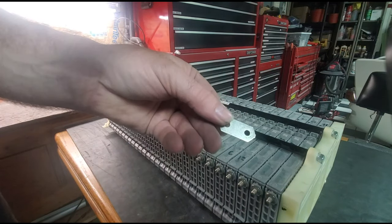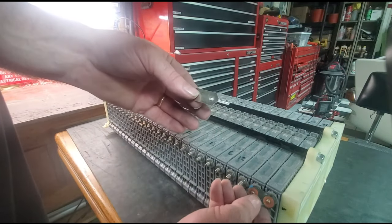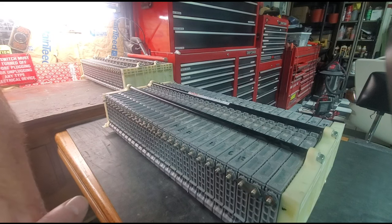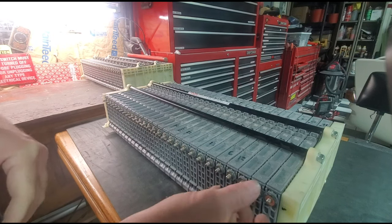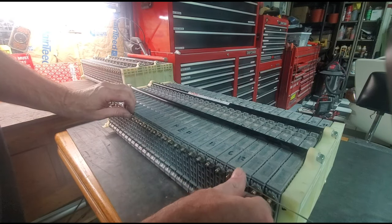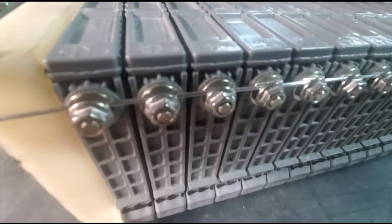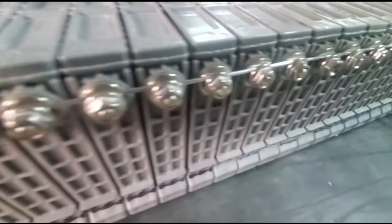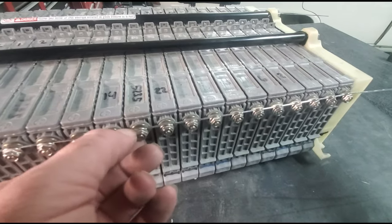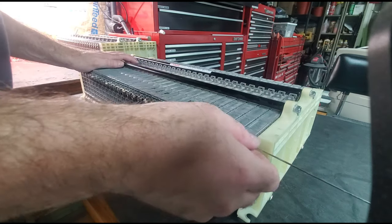If you have two sets of bus bars — your new ones and your old ones — you can just put them right here on the nuts over top of each other and do the pack with two sets. I use a piece of welding wire and lay it across instead. Either way you still have to put the nuts on. You can see the piece of wire going all the way down those nuts, and I've tightened the nuts down onto it with just a little bit of torque — just enough for good contact. All of these cells are now balanced and it's been sitting like this for 48 hours.